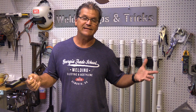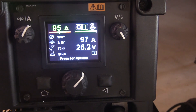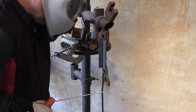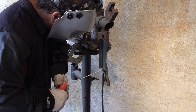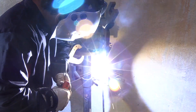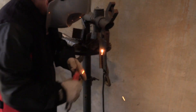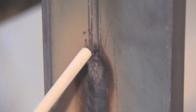I'm going to try to cover a lot of basics that I might tend to skip over sometimes. I've got this 210 MP set to 95 amps — I honestly probably should have gone up maybe five. I put a meter on it and it read closer to 100 amps actual, but the machine readout said 95. For the root pass I'm keeping a really nice tight arc, very little side-to-side motion — just enough to feel that flux scrub — moving very slowly so as not to leave any undercut.